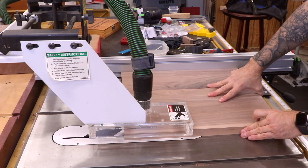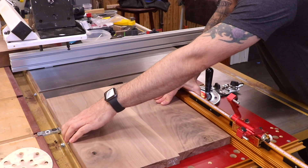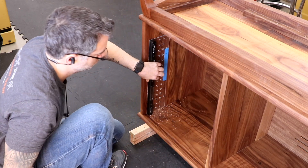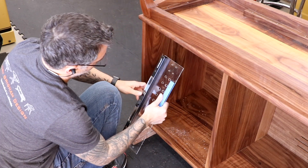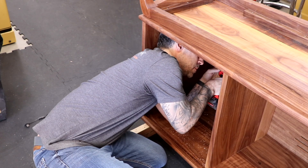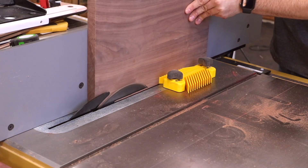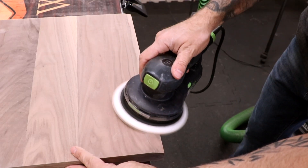The credenza has three adjustable shelves, so we glued up a few panels and then cut them to width. A few holes are drilled in each compartment. If you do adjustable shelving like this, don't make your cabinets swiss cheese — pick the most common locations and add a few options. You don't need to go nuts. The shelves are dropped in place and I notice they look a little bit thick — I'm using five-quarter stock for this. I don't want to sacrifice thickness, so to make them appear thinner, I put a shallow bevel at the front.